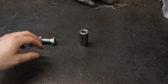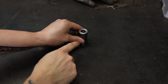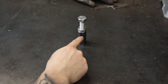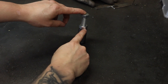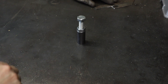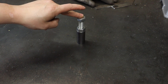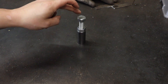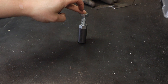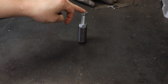The main body is all done now - we've got a 14 millimeter hole slap bang in the middle, and that allows our bolt to sit in there lovely. The next thing we need to do is weld a bead all the way around this nut, and then that machinist jack could go out and be used if you wanted. But once I've done that, I just want to tart it up and make it look more professional. So I'm going to crack on with the welding and then head back over to the lathe to tidy it up so it doesn't look so much like I've just welded a nut onto the body.